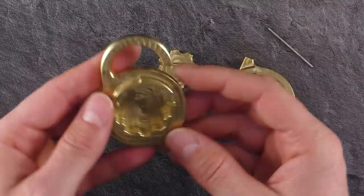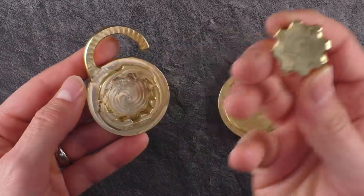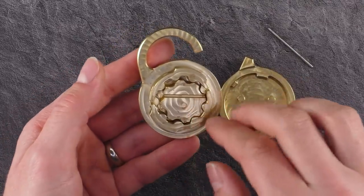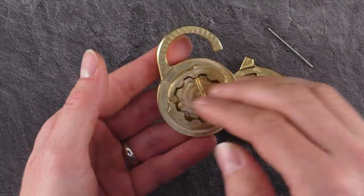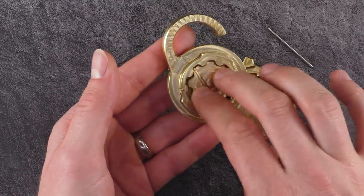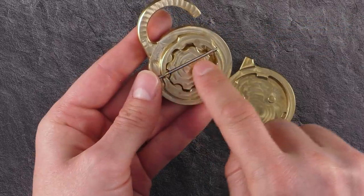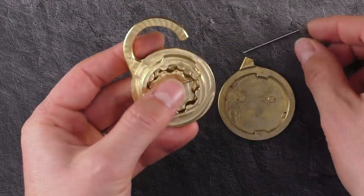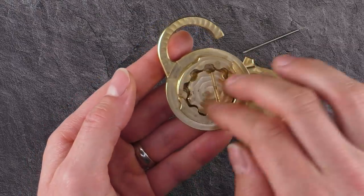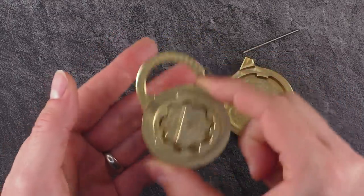It's super cool. We have a body part, and the body has this gear here. And there's also this — let's call it a pinion. This pinion is located inside here. The cool thing is it's not running centered, but it's running eccentric. That means it will make this eccentric movement. If it's in the correct position, I can put in the pin like so, and it will hide here inside of this notch. The cool thing — which I didn't mention until now — is you do not need to rotate it directly, which would be pretty difficult from outside, but you can rotate it by doing so. You can see how it turns — very, very cool. So I need to align it so that it gets into this position and the pin will drop into this notch.